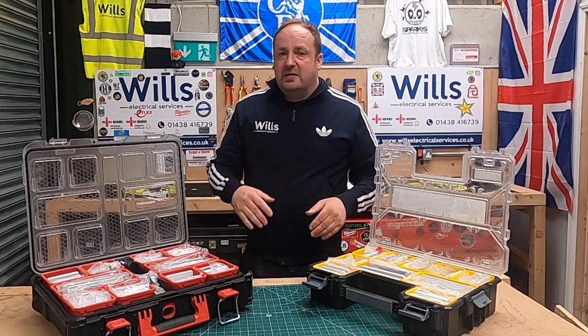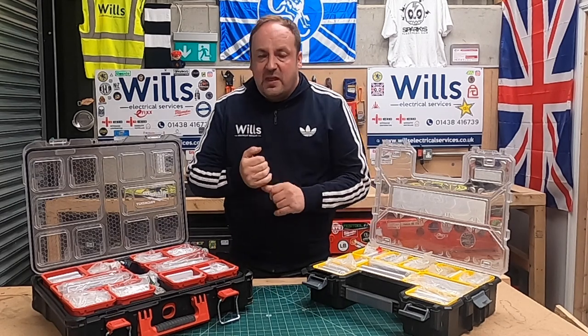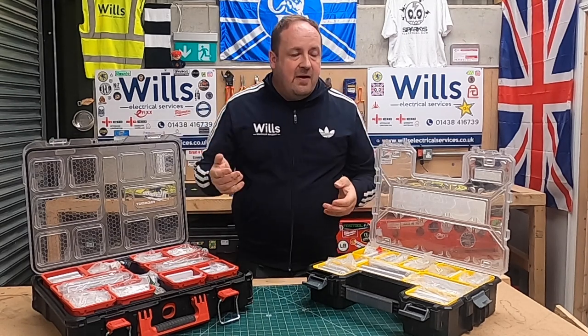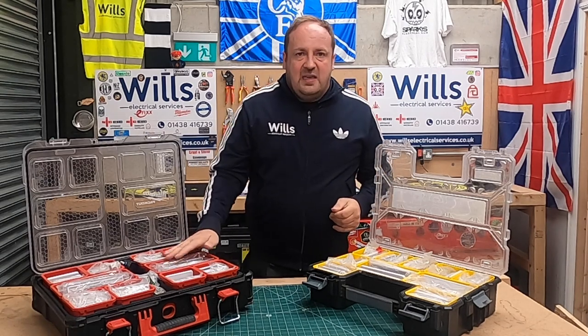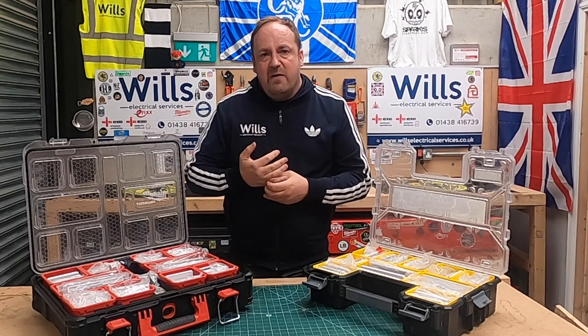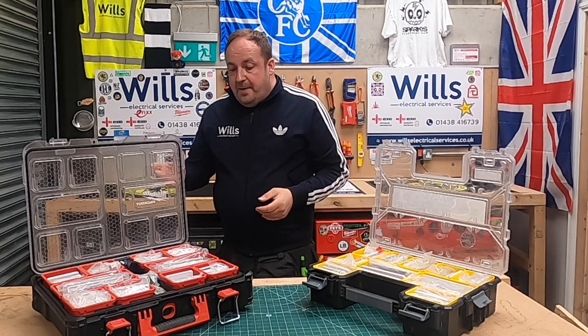That's the main thing, I'm all about getting home, you know what I mean? That's half the reason why I don't want to be going down to a wholesaler halfway through the day, especially when we're doing a lot of periodic tests. Sorry, can't say it now, can you? Electrical Installation Condition Reports and all that. If you're finding any C1s, like broken sockets and light switches, you can do the remedial there and then, and it saves booking in the remedial works.